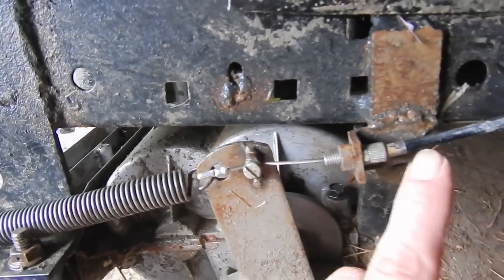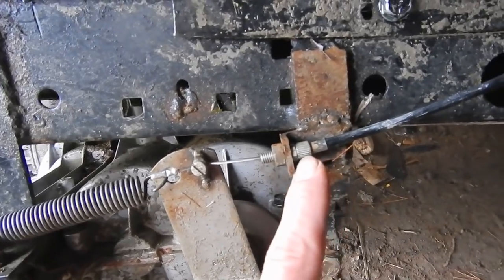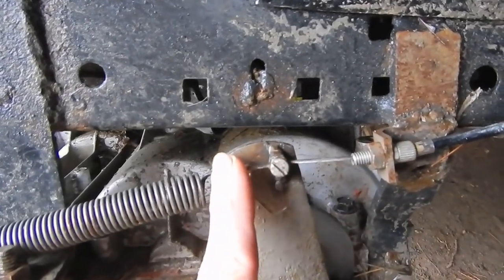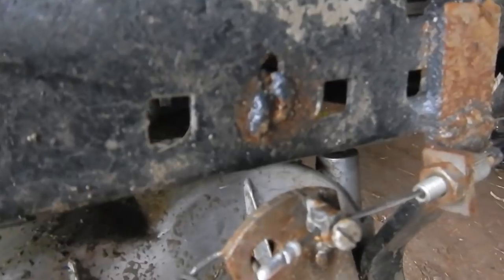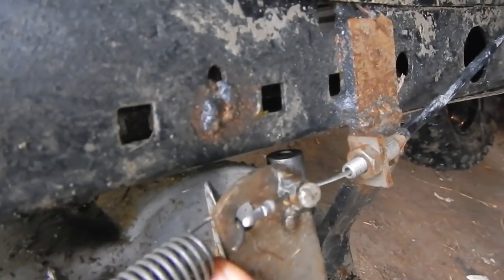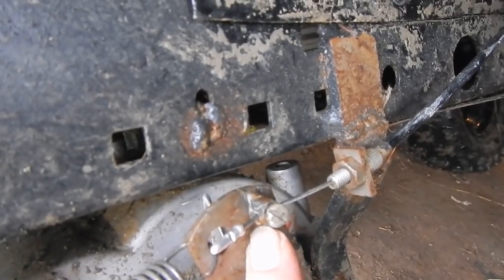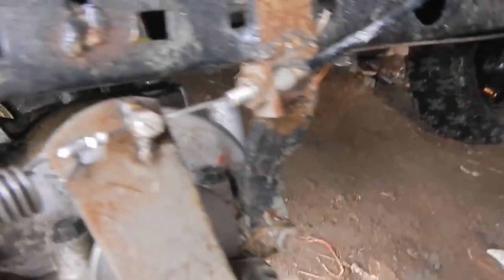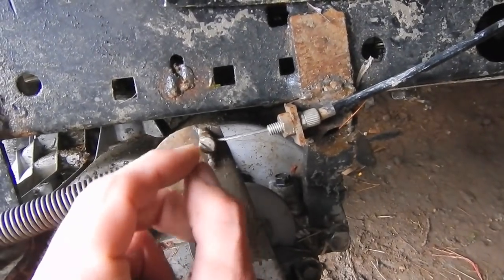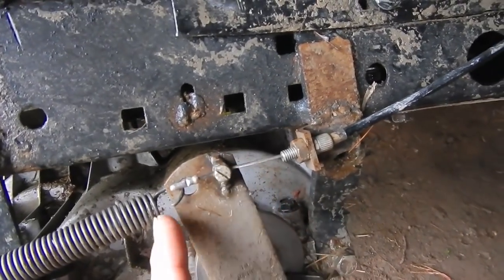You can get basically all of these parts except for the noodle on BMI Cart's website — I'll leave part numbers in the description for the wire stop. The wire stop is pretty important because it's basically what holds the wire to your brake lever. I welded mine to my brake lever because I couldn't figure out another way to attach it. A wire stop is essentially a nut with a hole drilled through the side — your wire goes through the side of the nut and then a screw threads down into the nut, trapping the wire inside. Tighten that down as hard as you can and it's not going anywhere.